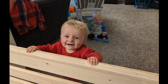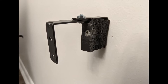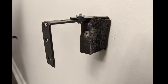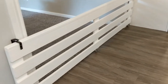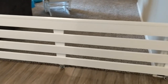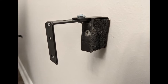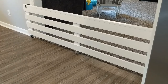To keep the gate upright while in place so that the twins did not push it over, I created these metal U brackets. Home Depot did not have anything like what I envisioned, so I ended up taking two metal L brackets and connecting them with a bolt to make a U. These U brackets were then screwed into the wall in three places — one on each side of the opening and the third further down the wall to keep the gate upright when it was not in use. I used thick foam weather stripping as a soft spacer on the inside of the U brackets to keep the gate from banging against the wall and to keep it upright.